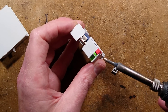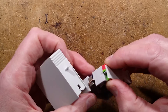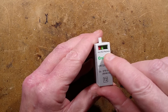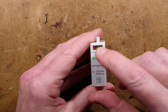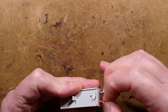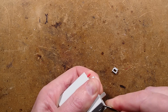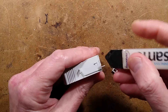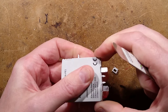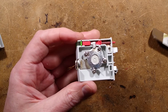It's triggered - it's gone up and pushed the green flap into the side, and the red is now the most prominent bit. Let's push it in and see what it looks like now it's tripped. The little green thing is still there but the red is now showing - red means replace. The red pin has also pinged in. Using the spudger to prize it open, let's get the rest of it to bits - I may have to melt the other solder link, or I can just undo these screws.